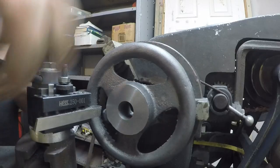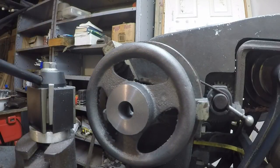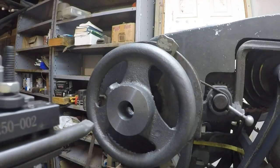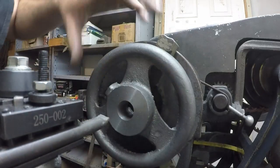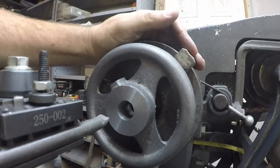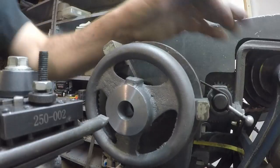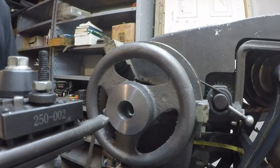I think we're going to leave it at that. Now on to the boring. I've got my boring bar set up, and I took a little calibration cut on there. We're right about three-quarters of an inch and we've got to go to an inch and a quarter, so we've got a really long ways to go. We'll probably be fast-forwarded right now.